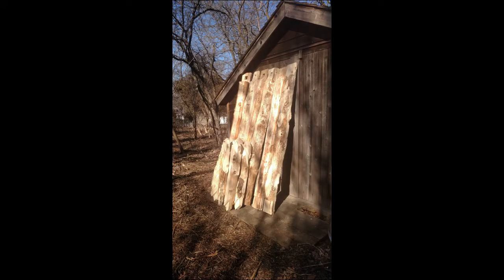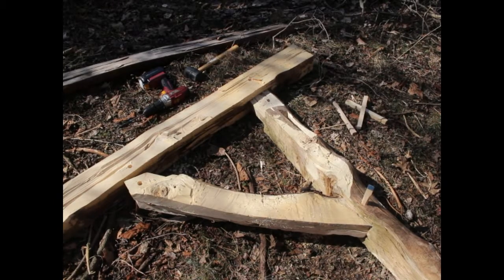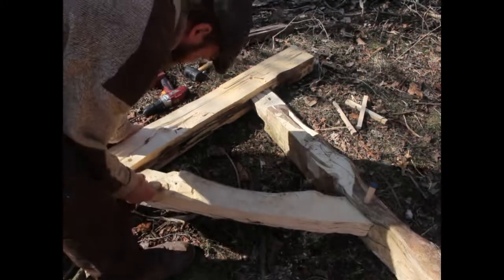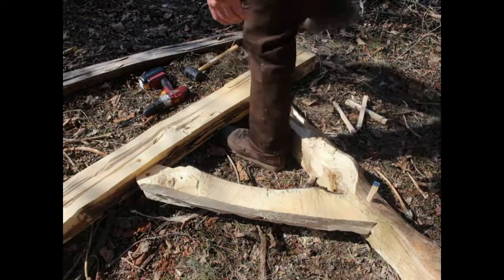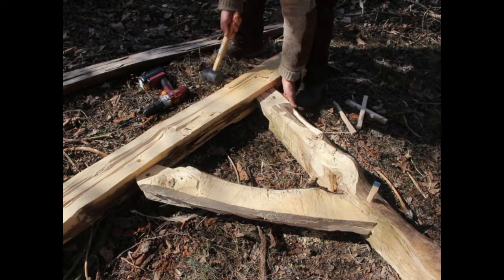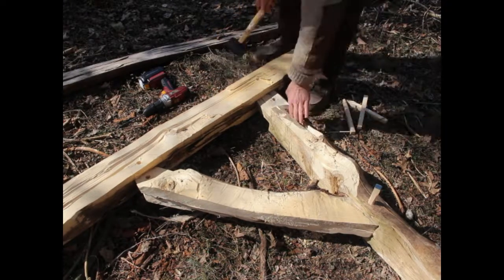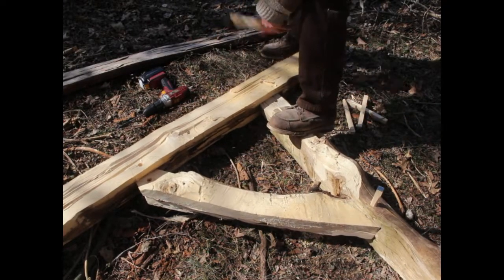And here we have the dressed logs ready to be put together. So first I put the two halves of the timber frame chicken coop together, and that involved fitting the top plate onto the posts, and while I did that I had to have the 45-degree angle braces fitting in as well. And you can see those small cylinders off to the side.